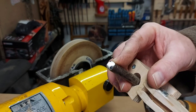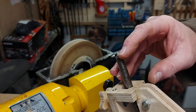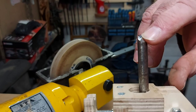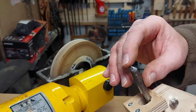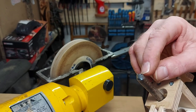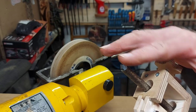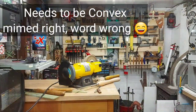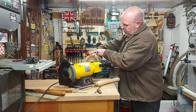You can see black still on the tip there — still a bit there but it doesn't matter, it's just going up. There's still some black on there, so all I've got to do is keep going until I get rid of that marker pen, and then I know I'm right up to the top. I also have to try and get these corners concaved going around like that, and make sure they're not dipping in.